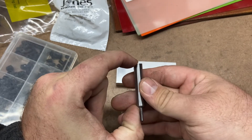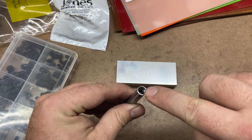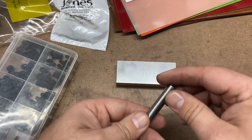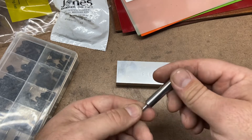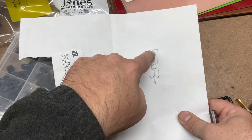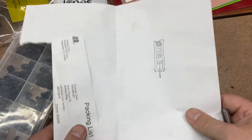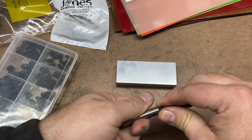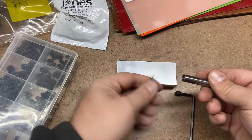As far as construction: the body length is one and three-quarters inches with a small chamfer mostly for aesthetics. I tapped a 5/16 by 18 thread into that about half an inch down, and then drilled a quarter-inch hole to just about a quarter inch from the end of the nose. From a cross section it looks like: set screw, spring, then the point with a bushing on it. To take it apart quickly — I didn't put any Loctite on yet, I'm not sure I need to. You could back it up with a second set screw if you want, and the spring goes in the middle.